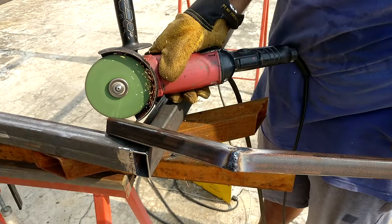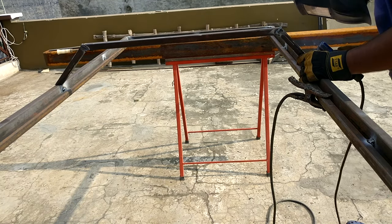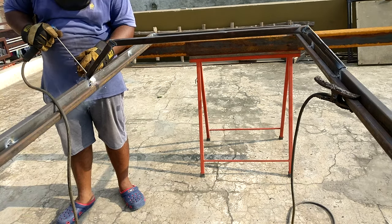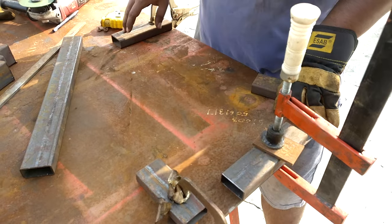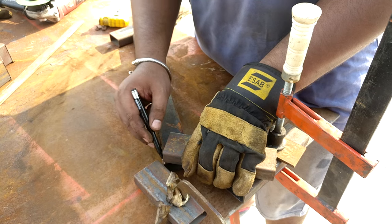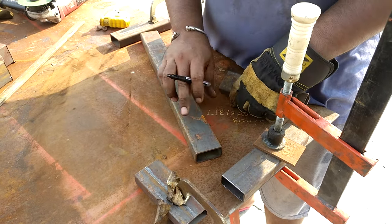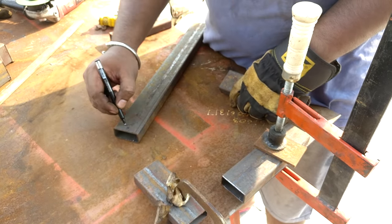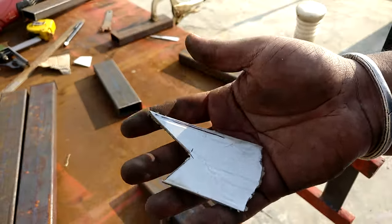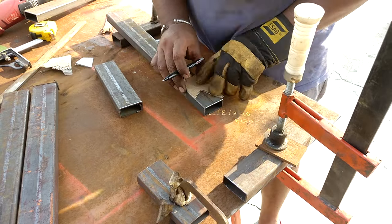It's completely optional to make the legs at an angle. To do repeated marking, I made a jig to transfer the same position on the same side repeatedly. The disadvantage is that I can only mark one side at a time, so to counter that I made a template so I can mark the same cutout on both sides just by flipping the template. Once the marking is done, I cut that area with the angle grinder to make a nice clean joint.